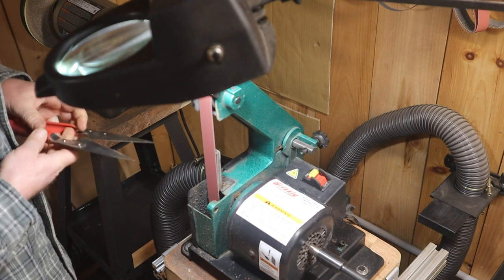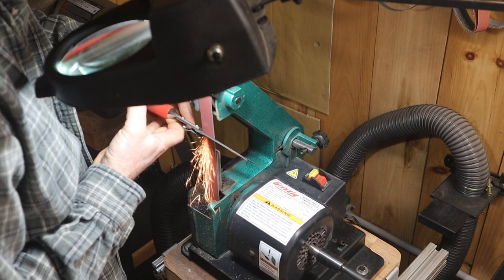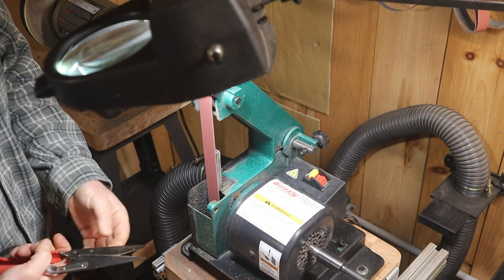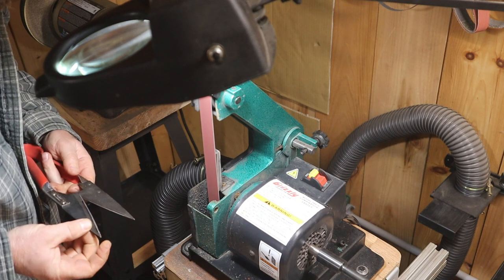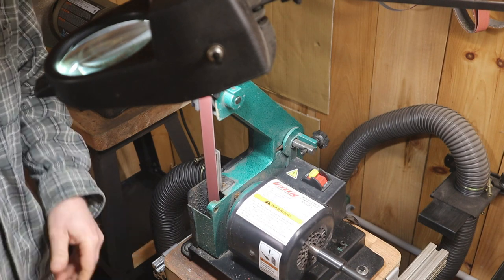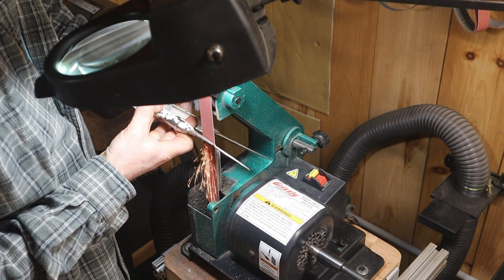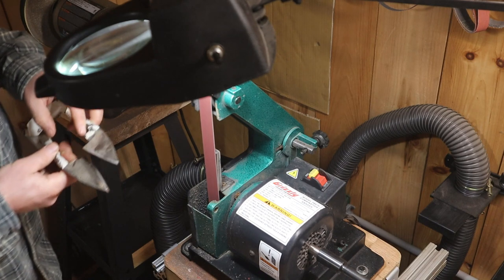I'm doing the scissor trick where you put them together and open the scissors — it pushes the burr back over to the bevel. I noticed the burr wasn't coming back up on the bevel over the whole thing, so we need to do more grinding. Also, be aware: in the past the blade in the back has contacted the belt and shredded it. This is a slow, mindful, deliberate thing. If you bring it too close to your body, that back blade will hit the belt and shred it or damage the blade — so don't do that.